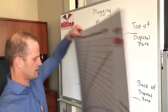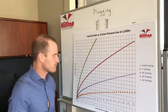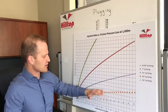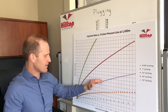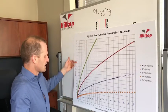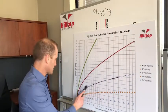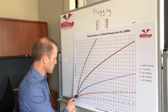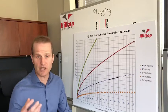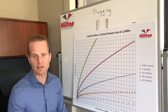I've put a graph together to help determine if plugging is the issue. This is a graph of injection rate versus friction pressure at 1,450 meters. I've got the different size injection strings on here: three and a half, four and a half, five and a half, seven inch, and eight and five eighths. Friction pressure loss is across the bottom in MPa and injection rate in cubes per minute up the side. So if you're troubleshooting — say you've got a five and a half inch injection string and you're only getting away a cube a minute — you're only losing about 0.2 MPa due to friction pressure loss from the injection string, which means if you're injecting at 7 MPa, it's taking all that pressure to push into your formation and your formation is the issue.